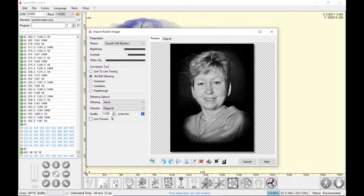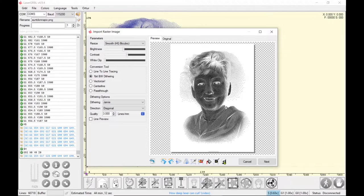My favorite engraving direction is diagonal. I'm going to preview it first showing three lines. If you have a lower DPI photo you would increase those lines; with a high DPI photo you lower those lines. Normally if I'm doing normal engraving I'll go six to seven lines. So there — I've inverted the photo to a black and white version.